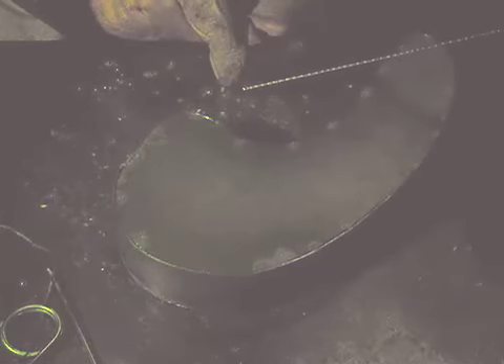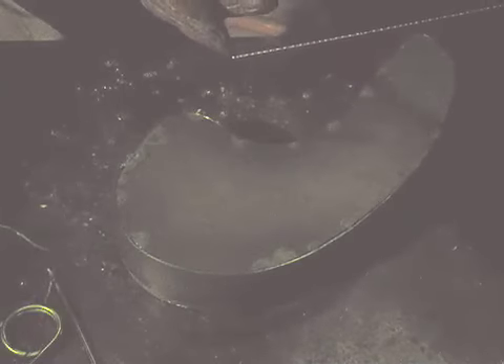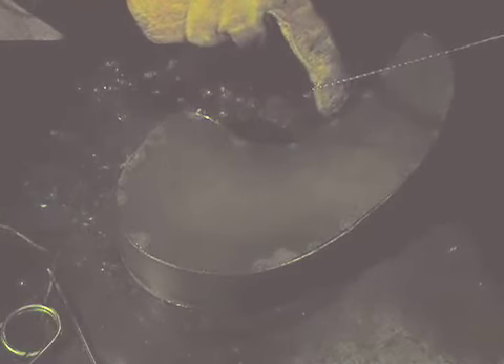I've created the base, and if your joints are good and tight all the way around, you can easily weld them together using very little welding rod. The welding rod I'll be using, since I'm going to use oxygen and acetylene, is a 1/16 inch welding rod — this is actually a TIG rod. That's all I'm going to need because the joints are so tight on this base that I'll hardly use any fill at all. Let's get started.